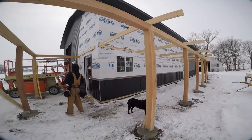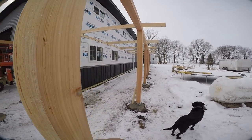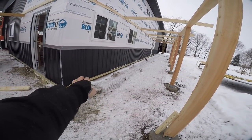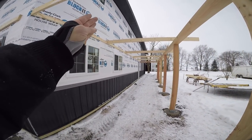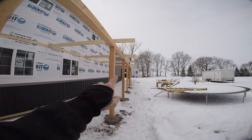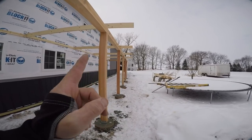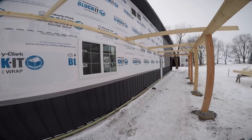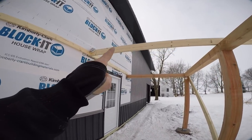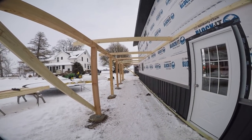We got everything up basically leveled out, we'll still straighten some things out when we put a line on it. With post frame construction there could be some inconsistencies — an eighth inch here or there from bottom to top. We put a string line at the bottom so we know that's straight, and we string the top — if there's any ins and outs in a 16-foot post it's going to show up there. We've put all these posts on our marks, then we'll run a string from end to end, cut them perfect, and measure back ten-and-a-half inches or one foot for our overhang to make it perfectly straight. Post framing is unique in that you can't really string the middle of the wall and brace off anything — you're stuck with whatever it is up top and at the bottom.